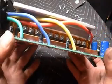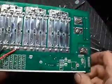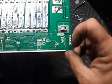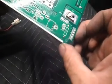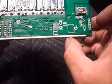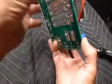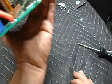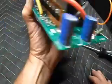This is your A, B, and C phases — as you can see the yellow, blue, and green wires. P minus — that's our ground wire right there. The red wire is P plus. 25 volt here, 16 volt here, VCC. It says 470UF and 100 volt on them two capacitors right there.